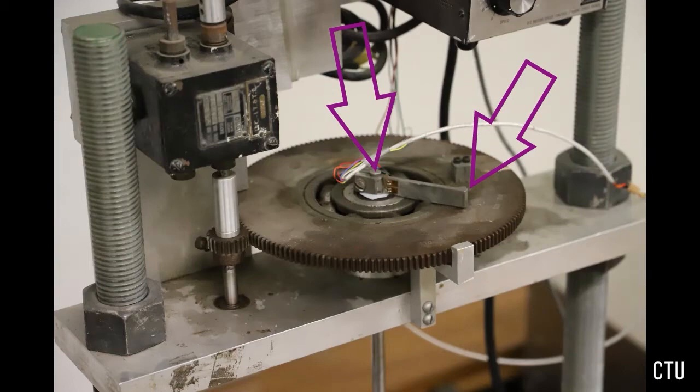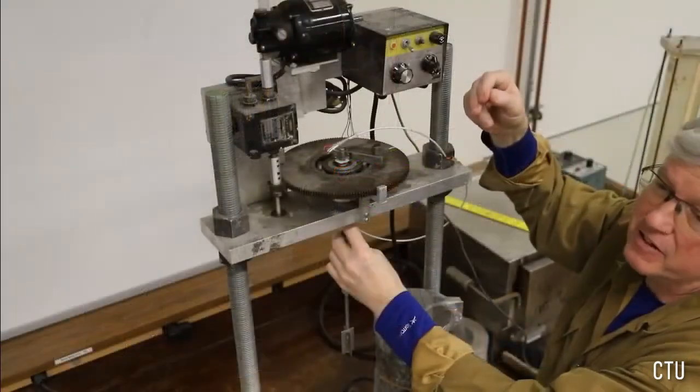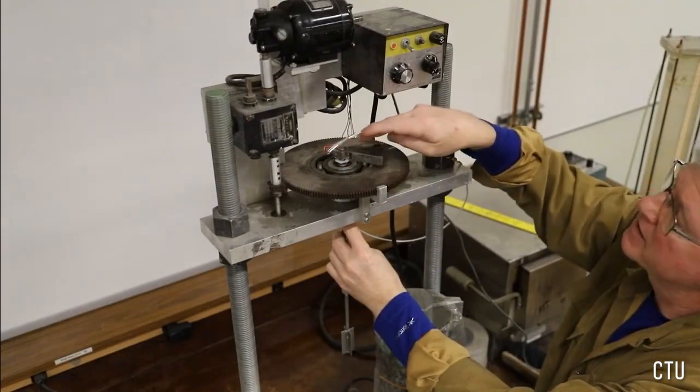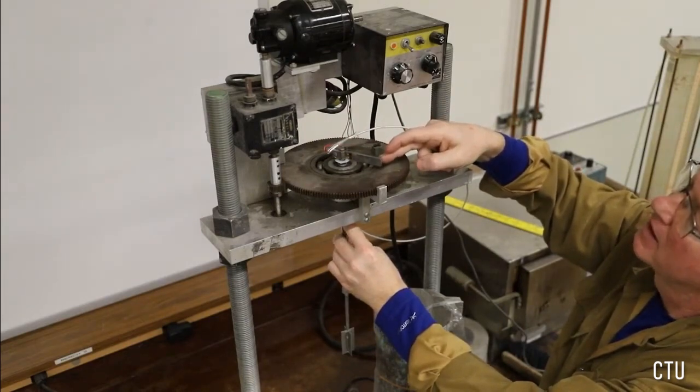So that blade, or that point of action, is at a constant known distance from the center of rotation. That bar has 4 strain gauges, 2 on each side, which are connected in a Wheatstone bridge. And so a signal conditioner can monitor those 4 strain gauges as a load cell. Essentially it's measuring the bending moment as the rod in the center resists rotation and the block is pushes on this end.